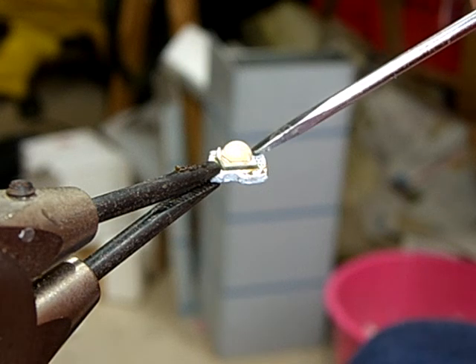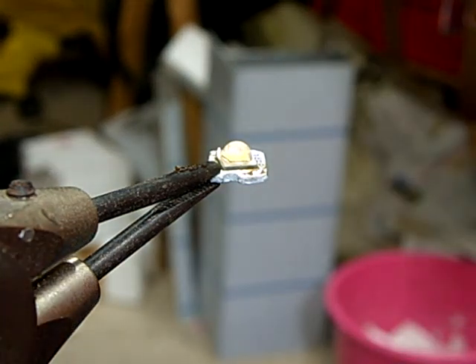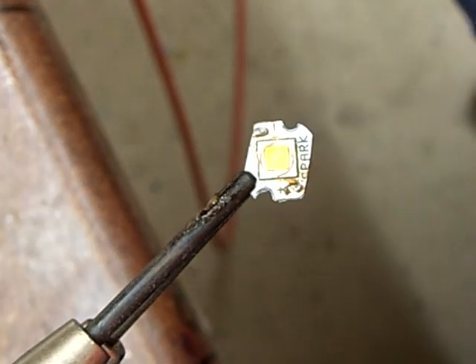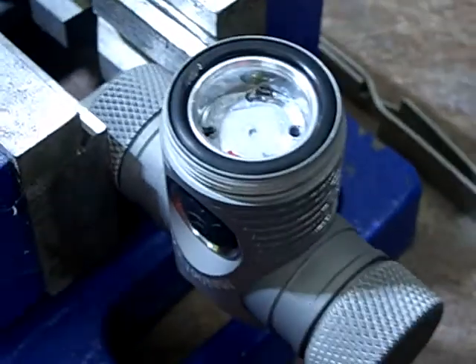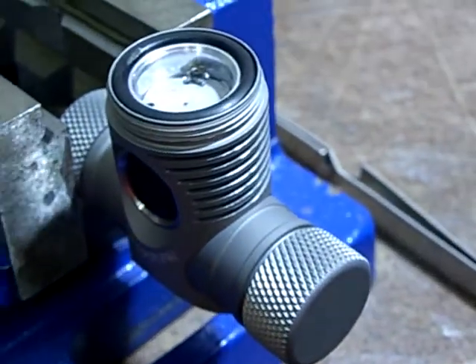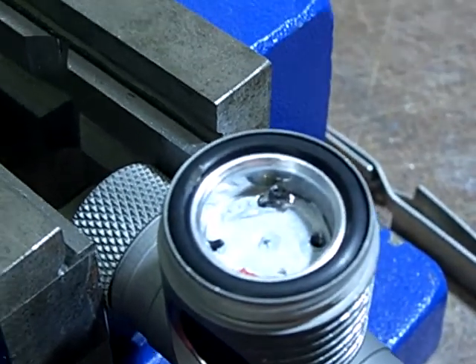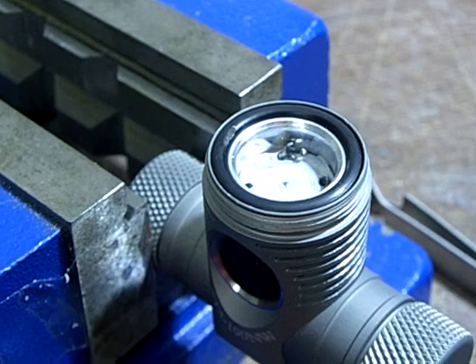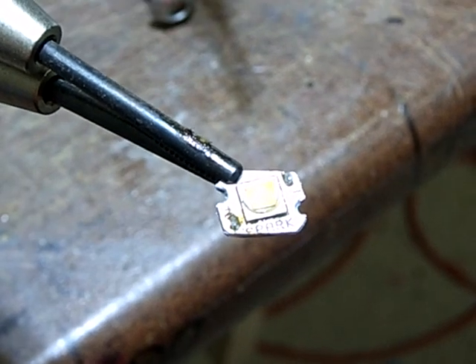Now the LED is sitting firmly on the whole assembly and everything is perfectly aligned. I'll show you a shot from above — you can see it's sitting perfectly in the center. This is the flashlight the LED will be going into. It's a Spark ST6, normally the one that takes one AA cell. I removed the reflector and built a custom heatsink, so I get a really floody light — like those Zebra Light things that don't have a reflector — and I actually like this design better. So now you know how to upgrade the LED of a flashlight in a more professional way. Thanks for watching.